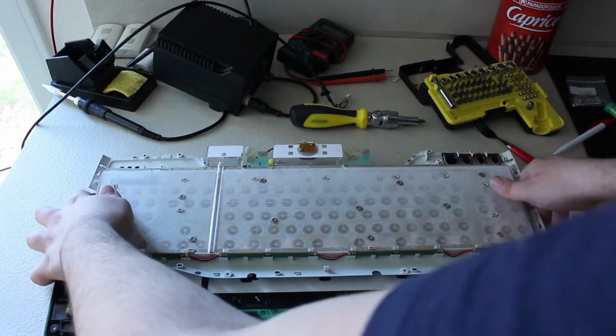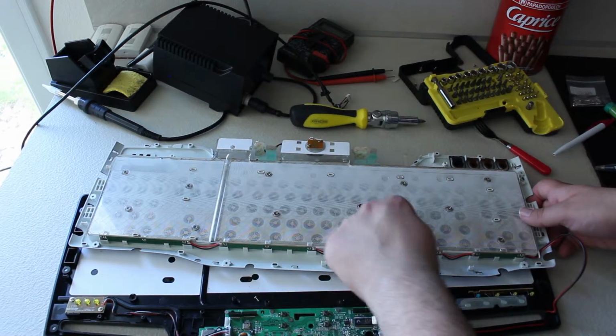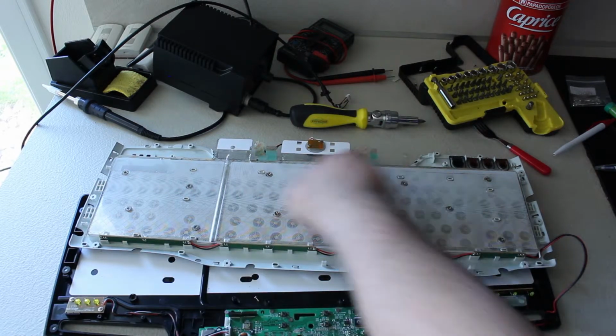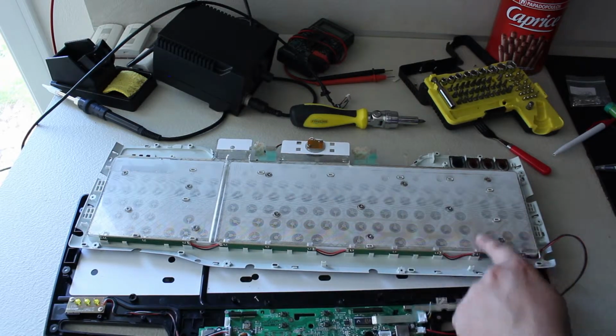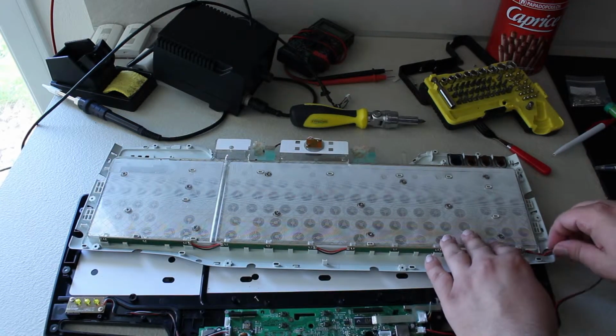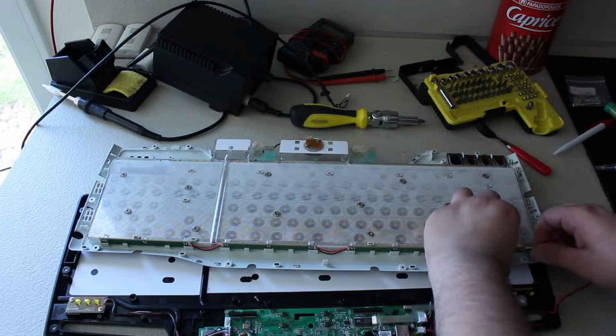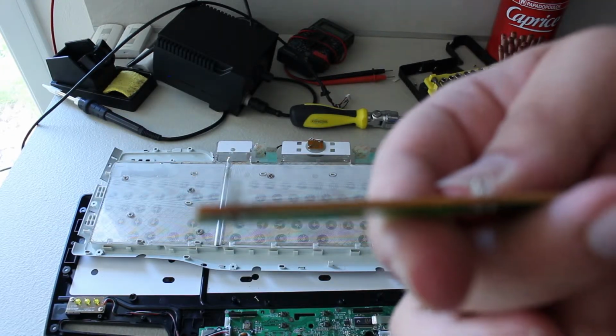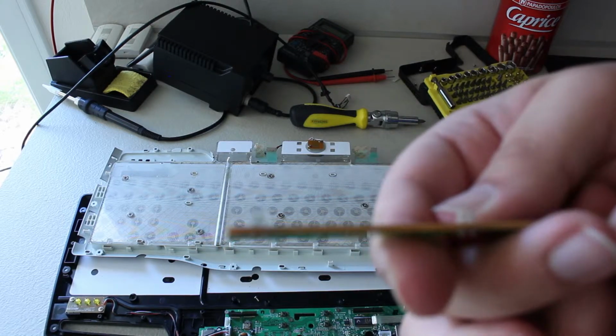And here, you can see the backlight system. This is actually it. So there's actually 9 LEDs, and there's a polycarbonate piece that the light shines through, and it actually illuminates the whole. So let's remove the LEDs, because that's what's causing problems. Teeny tiny little 3mm LEDs, if it wants to focus.